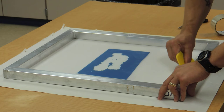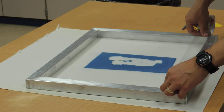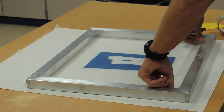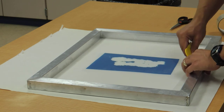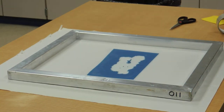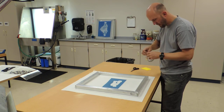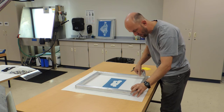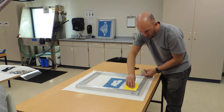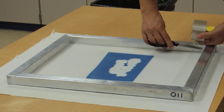Once I've done all of this all the way around, the last one on this side — going halfway down, getting my squeegee, and I'm overlapping this. Now it becomes infinitely easier. We are still working in that spiral pattern as we go around. I'm going to be taking my tape, and now it's even easier because I can start on one side. I'm overlapping my tape at least a quarter inch or more, starting in one area, and I can take my squeegee and just bring my tape down. It becomes nice and even, and once I get to the far end, I can cut it off.